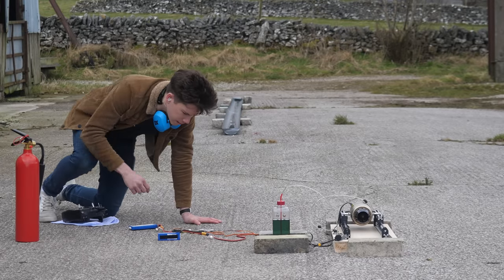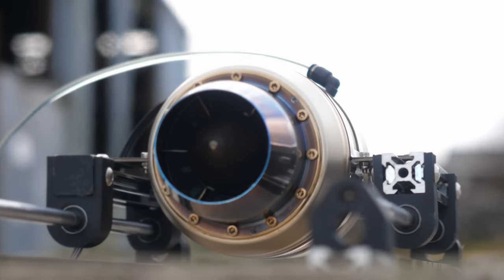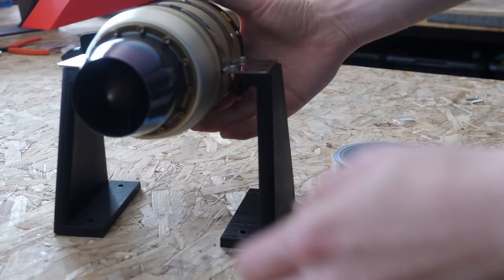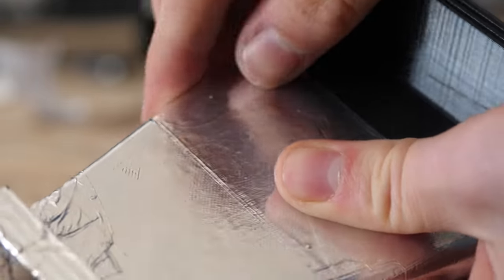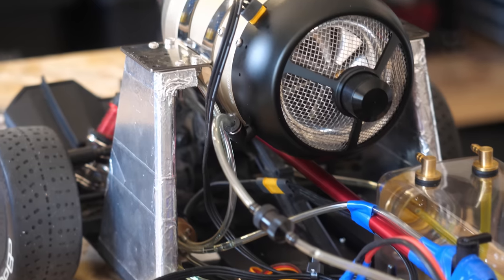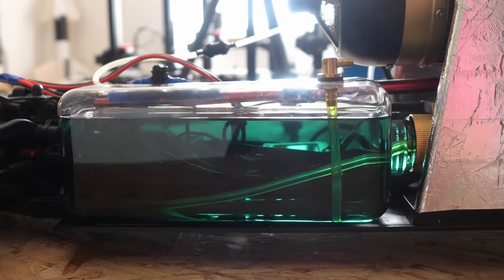Meanwhile, I could bring the engine out of hibernation and give it a run-up to see if it still worked. These things are intended for large-scale RC jet planes. This one produces around 120 newtons of thrust at full throttle, which is equivalent to a force of around 12 kilograms. Initially, I planned on designing some mounts which would first be 3D printed to check the fit before CNC cutting them from aluminium. However, while I was checking the fit of these 3D printed versions, I thought, let's just see if they melt first before solving a problem that might not actually exist. To give them just a bit of thermal protection, I wrapped them in aluminium foil to reflect some of the heat. To install the mount permanently, I drilled several holes in the chassis to bolt the engine mounts down and then bolted on the engine. I can now position the ECU and the other electronics for controlling the engine, hook up the radio receiver and install the fuel tank, which is just an off-the-shelf thing used for model aeroplanes. The fuel in here will not last long.